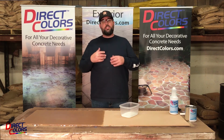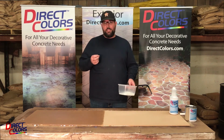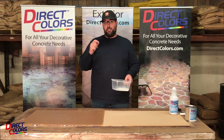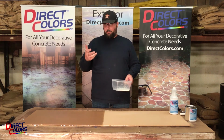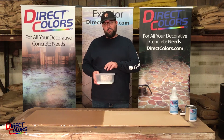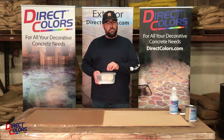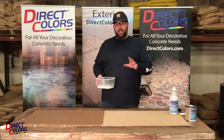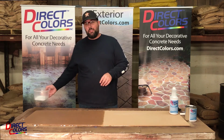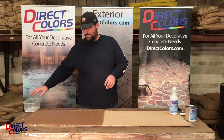I'm going to move over here, show you what it looks like with the solvent-based. Solvent-based is a great sealer. Most of the advantages come from the solvent-based sealer in terms of color. Pops the color better. Ease of application. This has a little more temperature restrictions. Whenever your temperatures are colder, you've got to be very careful about what you're doing with water-based. We've got a lot of how-to information on our website. You can check that out. That will let you know about the temperature restrictions on water-based. So I'm going to set that to the side.